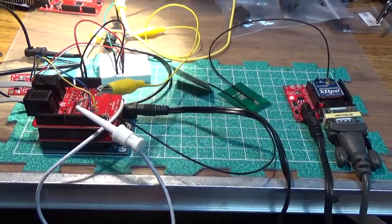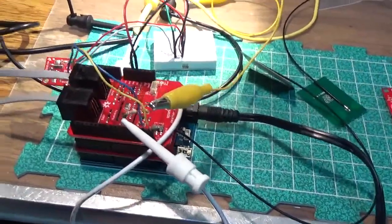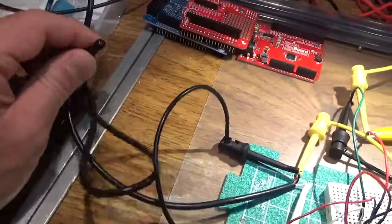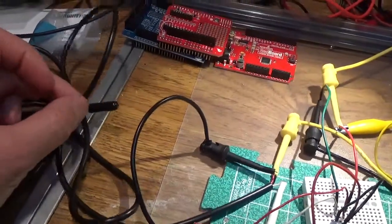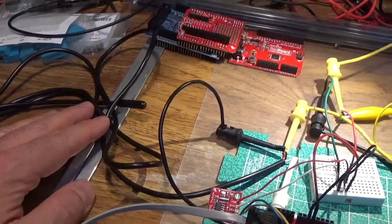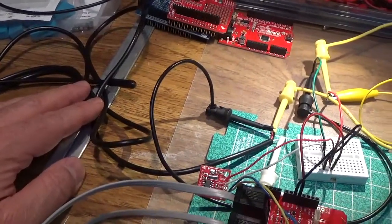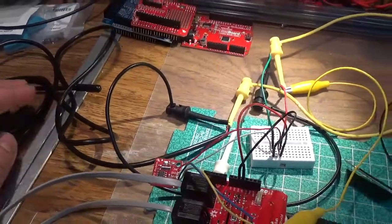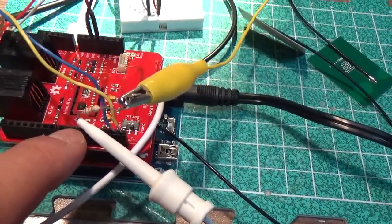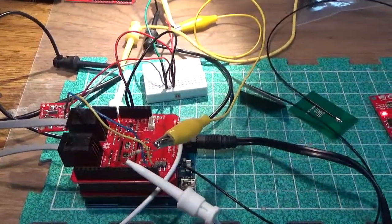What's new today: we have the digital temperature sensor right here. It's weatherproofed on a long wire, which is nice because I can just have it dangling outside of the weather station box without worry about it being affected by rain, snow, or ice. This one is connected to digital port number 10 on the Arduino. Sorry about the jumble of wires — this is just the prototype; obviously this would be cleaned up nicely.